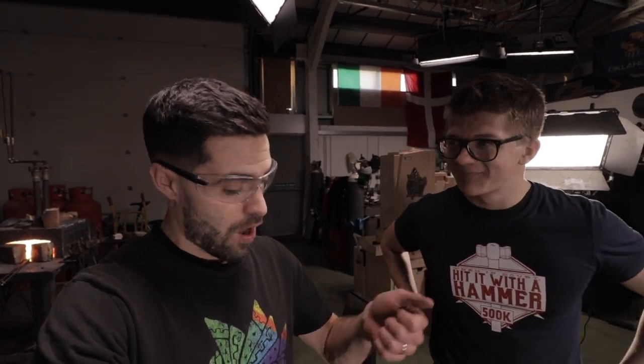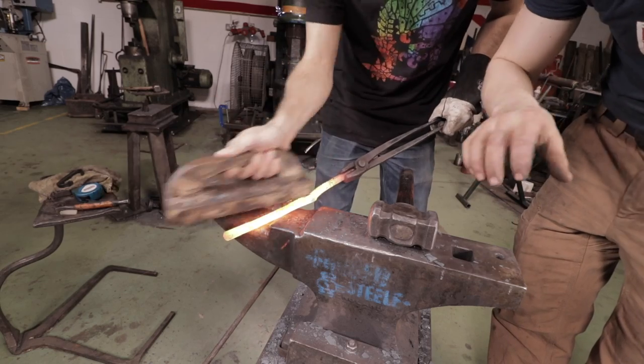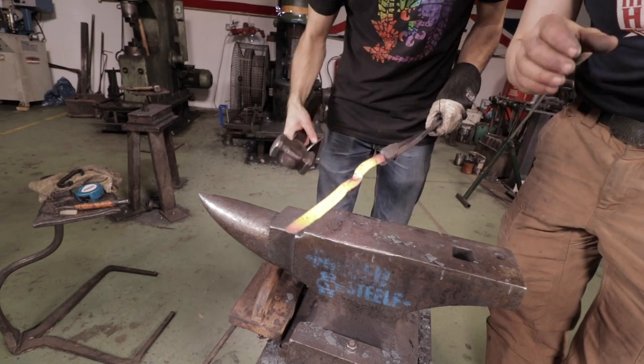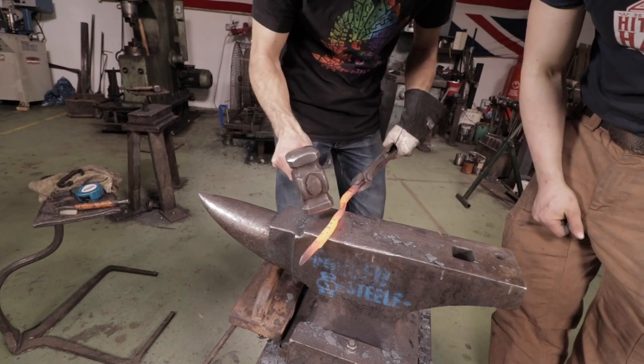It just takes building the muscle memory — it takes doing it more and more and you pick it up. I've also noticed you don't take into account how much your other hand is supporting the steel with the tongs, how much you need to be wary of it, because you focus so much on the hammer that you're not really focusing on the angle of the steel on the anvil itself. Lots to think about, but that's all part of the fun. Alex, just explain what giving it a brush does. So when we're heating it up, you see all these flaky bits that occur on the surface — that's essentially rust, it's iron oxide. Because it's so hot it reacts with the oxygen really fast, but it doesn't become part of the steel when you hammer it in. So you want to get it off so you're not putting divots into the metal.